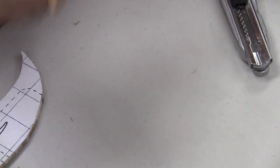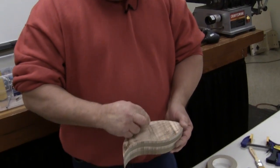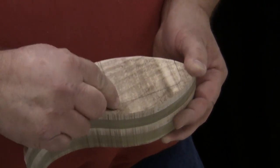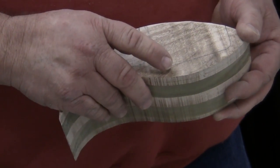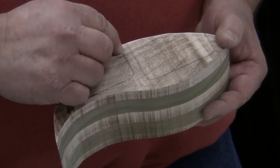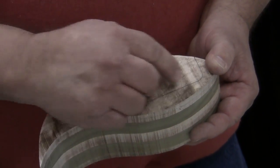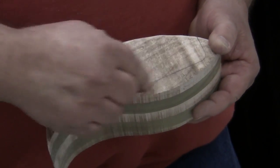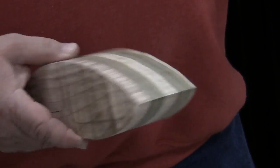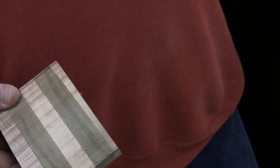And as we're cutting it out, the first couple that he cut out at the house, I was showing him. He was trying to go over here and make that sharp curve. With a 3/16 blade, you can, but you have to really maneuver it and take your time. What I do is cut straight down the line to here and down to here, and then I cut from here around and make a curve. Take that section out in there. I don't need those pieces anymore. It's nice to make these boxes because you end up with byproducts.